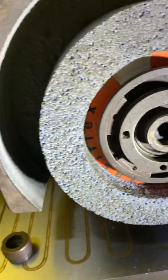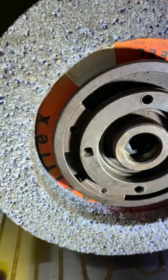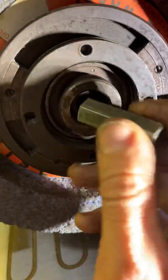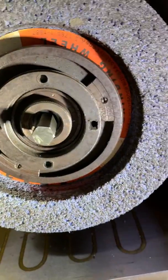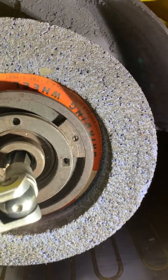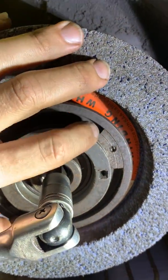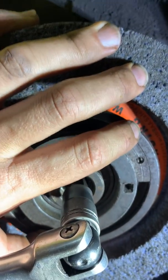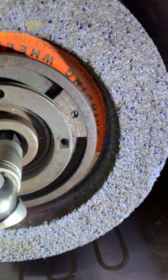Then it just comes out easy. If you get in there and start rattling it trying to get it off, you're just going to completely and utterly destroy everything. You can use these things - they shouldn't be excessively tight, they don't need to be ridiculously tight. What's going to be pretty firm is the retaining ring that holds your grinding wheel on, because if that slips when you turn your machine on and off, especially on these big direct drive grinders, it's going to throw your wheel out of balance.